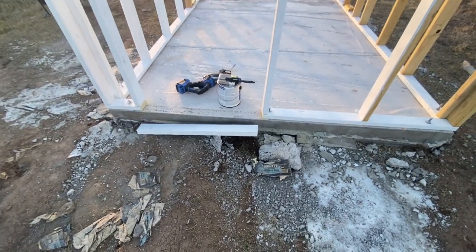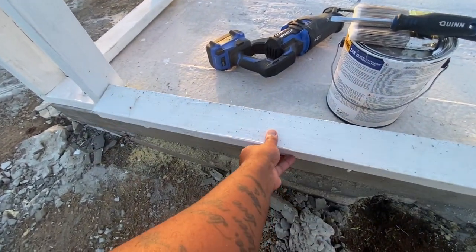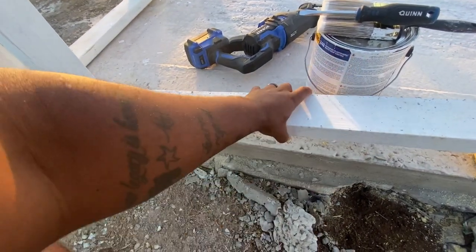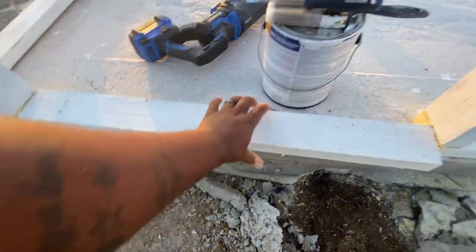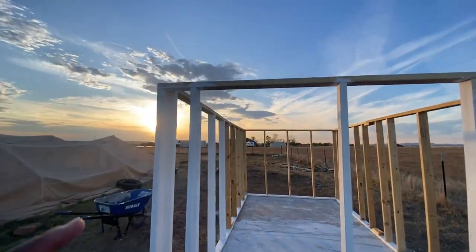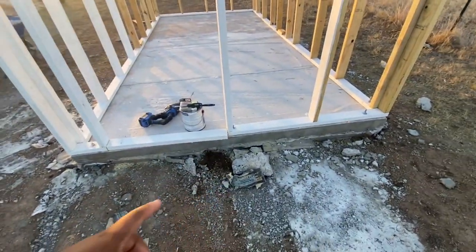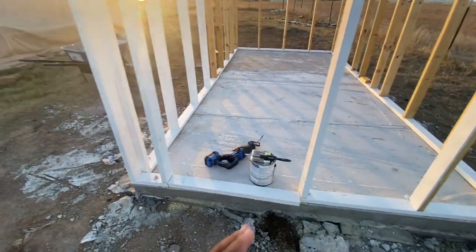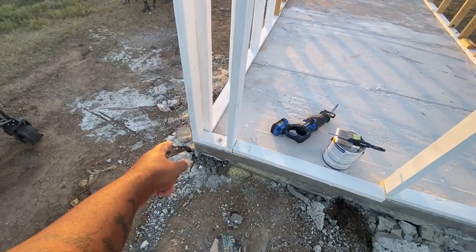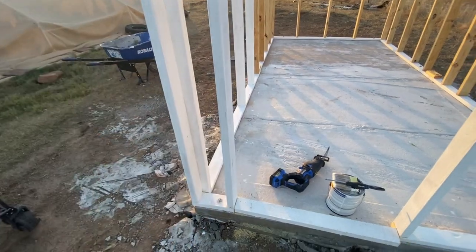If you don't know, if you're building a frame wall that includes a door, let me show you. Originally, what I did was I framed up the wall. This is the piece that comes from right there. The reason I did that is because I wanted to make sure my top plate — the length and width of my top plate matches the bottom. And if I would have built it without using a complete bottom plate, when I came to anchor this in, there's a chance that it could have swayed in or swayed out and made the whole wall bow.